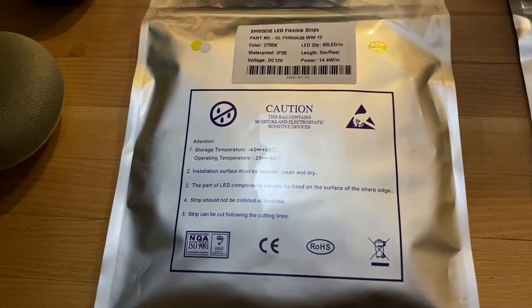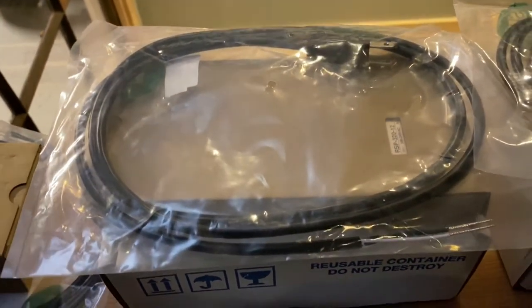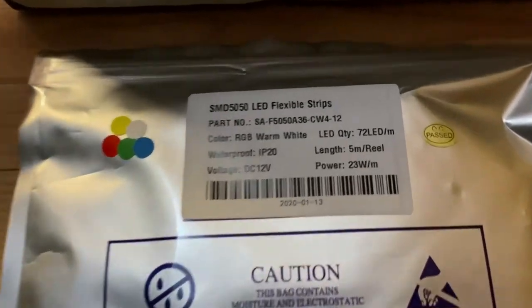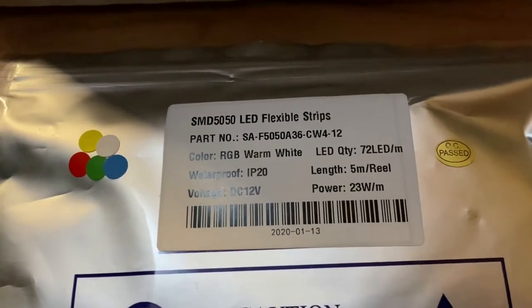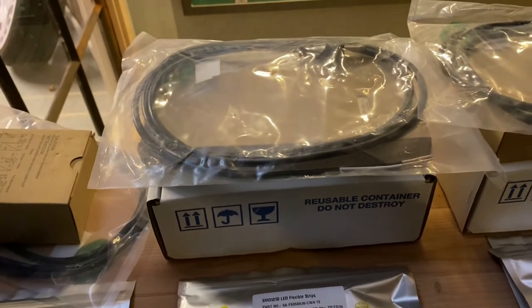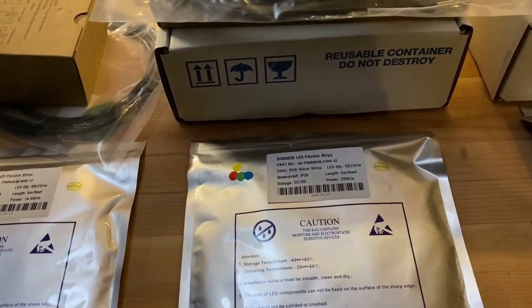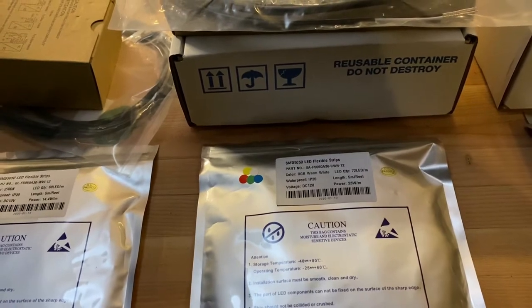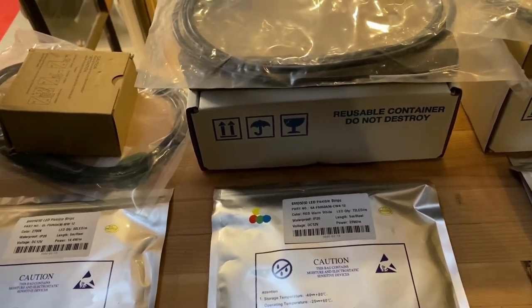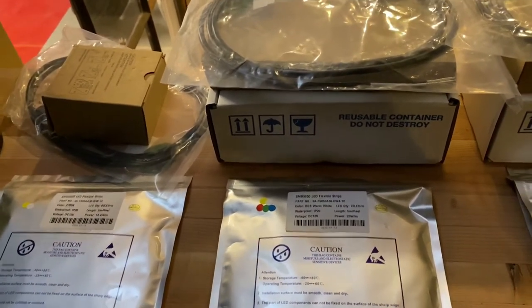Getting back to this one, we'll run the step lights. The second zone is actually using an advanced controller with a 320-watt fan-cooled power supply and RGBW lighting — this one is much brighter at 23 watts. This zone does the up-lighting and speaker lighting behind the screen for the LCR, the subs, and the two side speakers, so we can have a demo mode that will light up all the speakers. The demo room is getting in-ceiling rear speakers that adjust out to hit the rear, so we won't light those up.